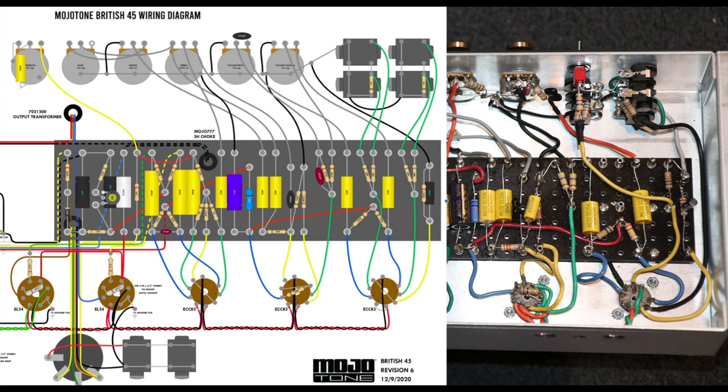When you flick the switch, either up or down, it's bringing these other resistors in parallel with this 10K. This is ground and this is ground, right? So this is one side, and then when you toggle the switch, you're bringing in either this resistor on top or the resistors underneath. And the setup is 10K is what you're getting in the middle position. When you flick to the second stage gain, you're getting a 4.7K resistor now in parallel with this 10K. When you flick to the other way, it's a 3.3K resistor with a 0.68 microfarad bypass cap. Same one here. It's underneath us, you just can't see it, but it's there.